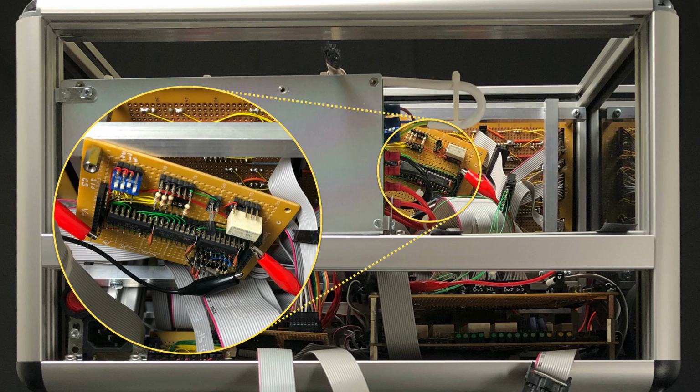Using an 8-to-1 selector chip, I can pick off a specific speed using the dip switches. In practice, 64 Hz locks up the relays, so 32 Hz is the fastest I can reliably go. Eventually there'll be a proper clock card in the computer, but this will do for now.